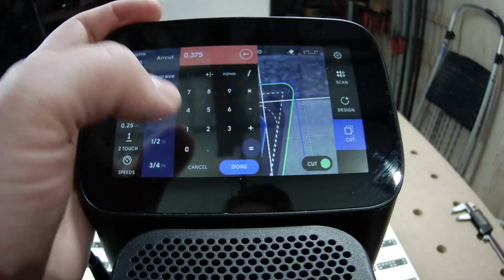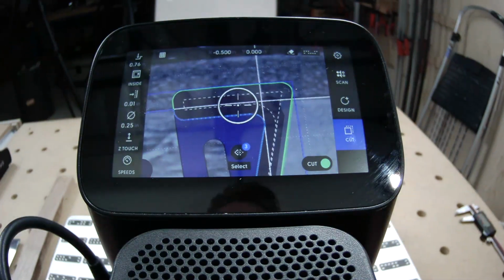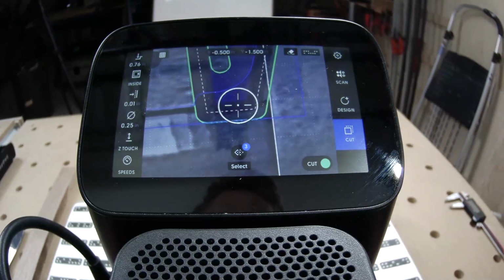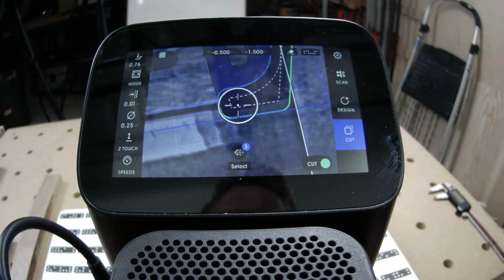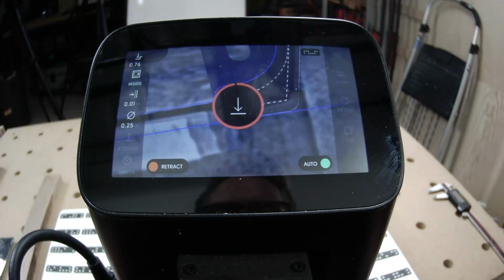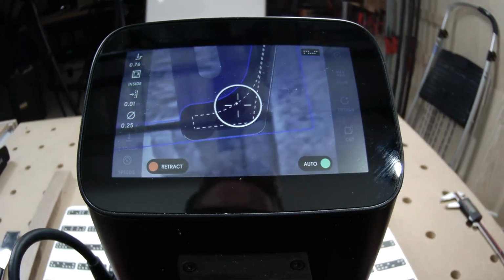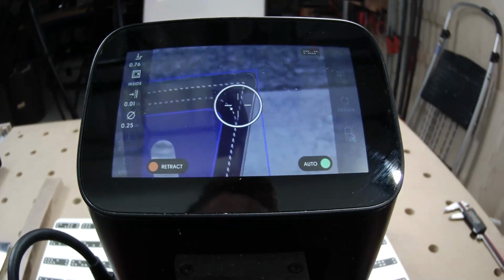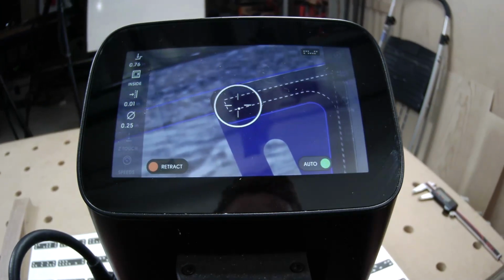Leah did a couple of little programming tricks for this one to make sure that cut path fit all inside the boundary of your workpiece, so you aren't overstretching too much and you're only cutting what's necessary, which I think is pretty clever. So that's why that's an inside cut, which you might not expect, but still the same process. Start with an offset, cut the whole thing to depth, and then go back in with 0 offset for a finish pass.